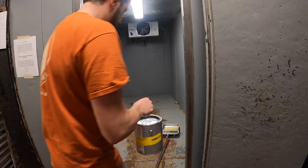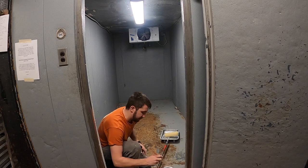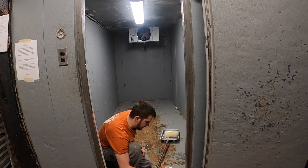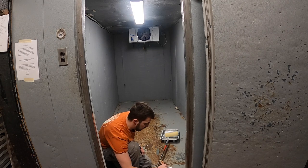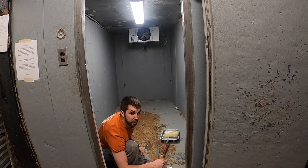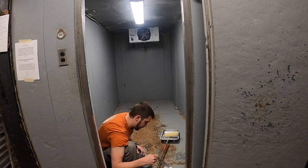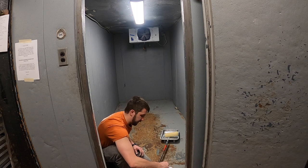You can see how thin the paint looks — there's nothing wrong with your paint, it's not old. All the solids are at the bottom, so you've got to mix this for a good couple of minutes. You'll feel how thick it is at the bottom — it's every can. I saw a couple of reviews online where people thought the paint was bad. It's normal. Just make sure you stir it to the point where there's no more of that thick, cookie-like stuff at the bottom. You really want to make sure these chemicals are mixed together well so it works.